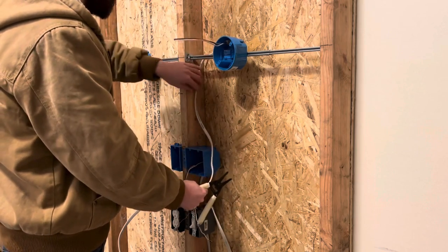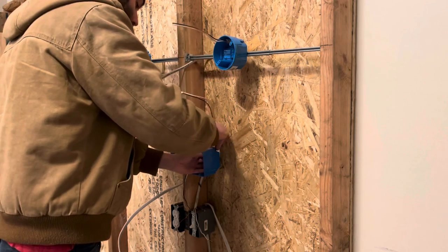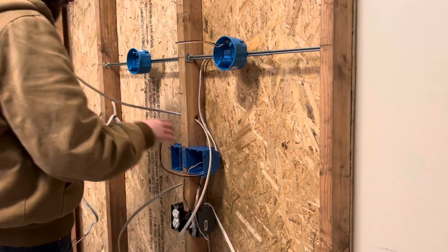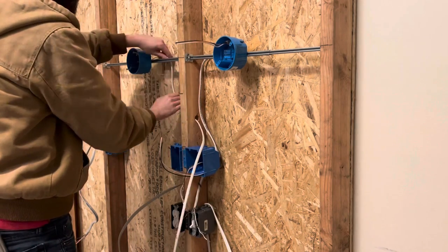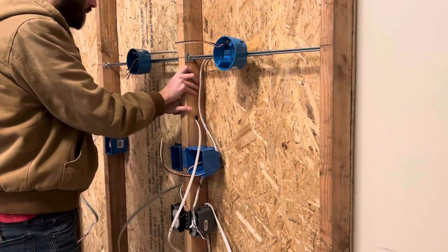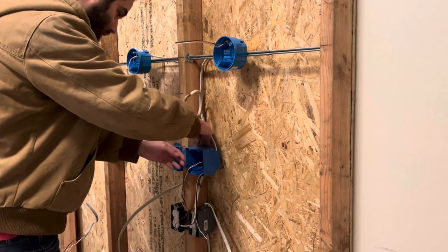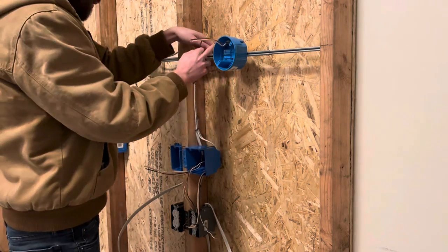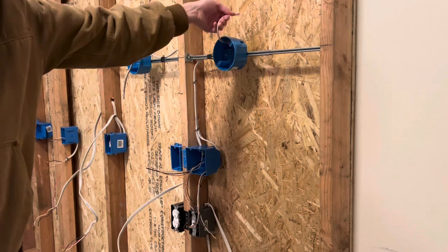To keep the wire safe, I went ahead and put the wire behind the bar. That'll make it easier to install the tape later to support it and also keep it less likely to damage. Go ahead and strip your wire before you put it in the box. I like to put the right switch leg in the right side of the box to signify that it goes to the right light, and the left switch leg in the left side of the box to signify that it goes to the left light, and put the power wires in the middle of the box. Take your next wire, strip it, and put it in the box, leaving enough wire to make a nice corner into the box. Wrap it around the bottom of the box and cut, then strip it and remove the paper from the ground, stick it inside the box, and staple it. Throw a second staple on top to make it look nice and keep it protected. Then throw two wraps of tape around each of the wires to the spreader bar to give it extra support and make it look nice.